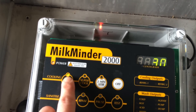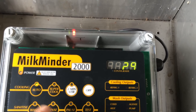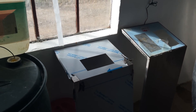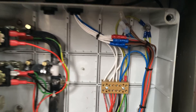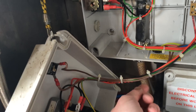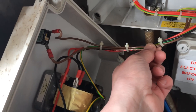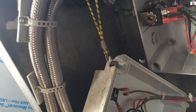You've got a time delay the first time you press it — I think if you press it again, it's on straight away. It gives you a time delay for your first milking. So we've just got a cover to put on and the laminate sticker. I've already tidied that up with a couple of cable ties. I've just got to put the cover back on there. I usually put a bungee or something just to take the weight of it, because otherwise you've got the weight of these two chemical pumps, which are quite heavy, rested on the wires and tubes.